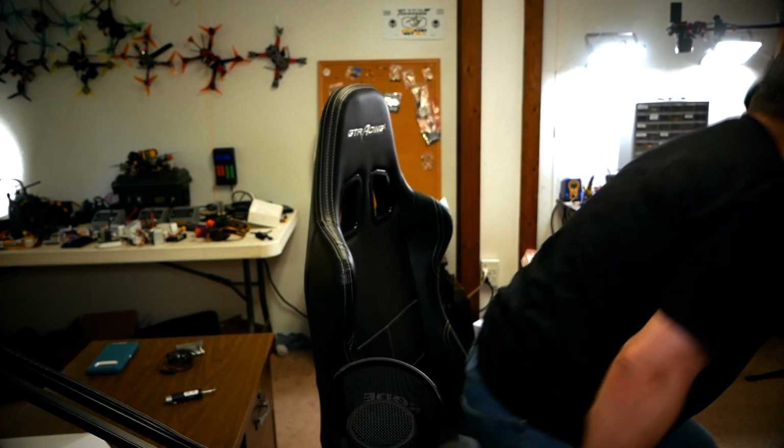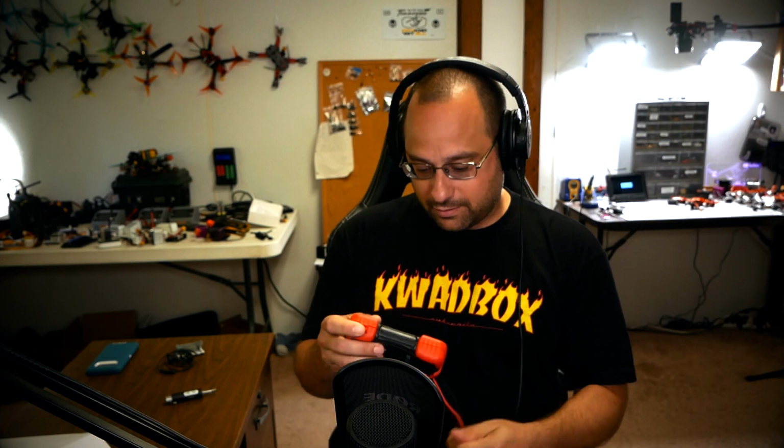I'm going to do this just out of curiosity because I've never done it. I'm going to test continuity here, and I may destroy my multimeter or hopefully not start a fire, but let's find out what happens together. I'm a little nervous. Maybe I should do it with a smoke stopper. No, because the smoke stopper would break the continuity function because it has resistance. All right, live dangerously. Here we go.